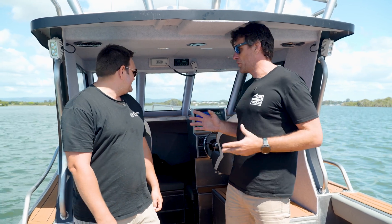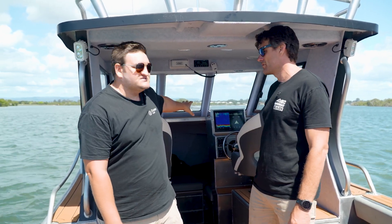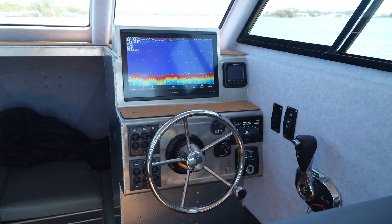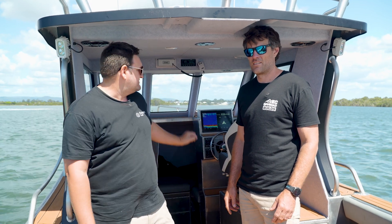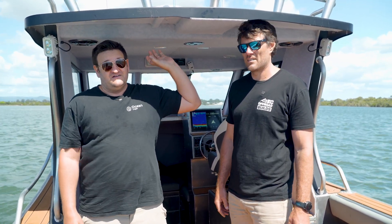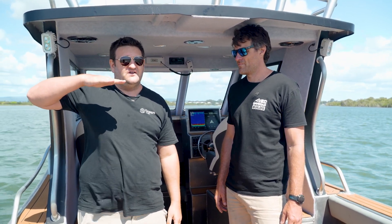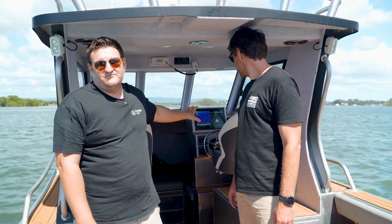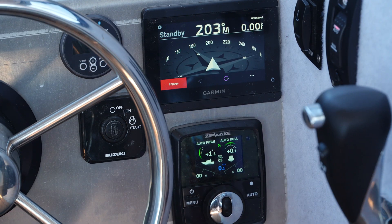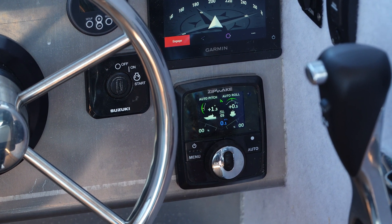Now onto the real magic of any boat — the Garmin fit-out. Garmin's no stranger; I've had it in just about everything: cars, boats, caravans. We work pretty closely with Scott from Ocean Logic. So, starting with the brains of the operation — you've got the GPS Map 8416 from Garmin, one of the flagship models. That's tied into a GSD 28 sounder module and a one-kilowatt dual-frequency transducer on the back, giving you a great image. We've also got the MSC 10 GPS compass — a really understated product. What it does is take heave out of the image, so you've got heave compensation built into your sounder and the swell isn't interfering with your picture on screen. Autopilot with a brand new Garmin smart pump — these things drive amazingly. We've also got the Zipwake automatic trim system, so this boat is level and pitched correctly no matter what you're doing.